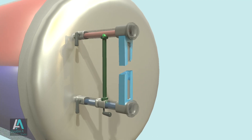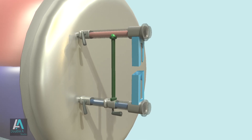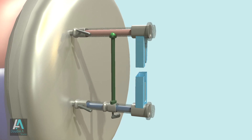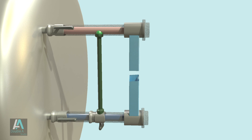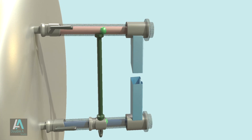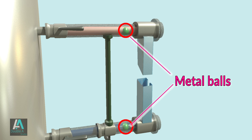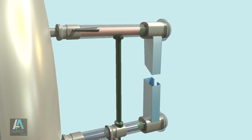There is a safety mechanism inside the device which prevents escape of steam or water in case the gauge glass tube breaks. Two small metal balls are located inside the upper and lower metal casing tubes, which provide automatic shutoff of the steam and water supply to the gauge glass in such a case.